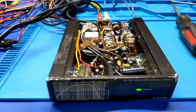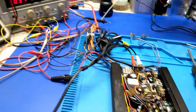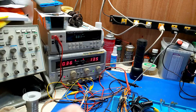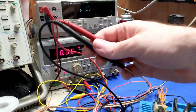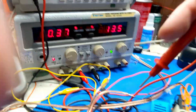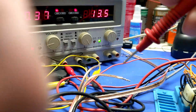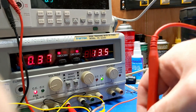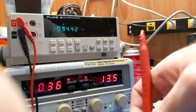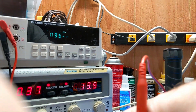Alright, I have power connected and everything is on. Idle current seems a little high for something that's not got a transformer in it, but I'll give it the benefit of the doubt. Before I just start connecting my speakers, I want to look at the DC offset at the speaker jacks. This is not a split rail amp, so there shouldn't be any DC unless something is wrong — like if one of the output filter capacitors is bad. Let's go ahead and check that right now. 0.9 volt. Let's check the other one — nothing.